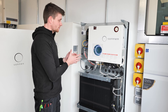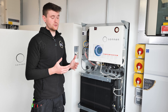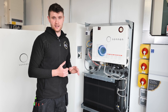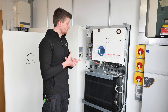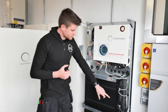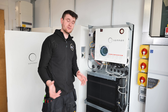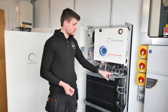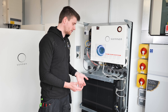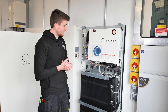All that comes into these power units is a main power supply fed from a local AC isolator, a six-millimetre cable, and a hardwired internet connection going back out. The Sonnens must have a hardwired internet connection — both for security and for the volume of data they transmit. On the master battery there's also a Modbus meter cable — just a Cat5 or Cat6 cable — going out to the meter. Battery power and BMS communications cables plug into the power unit so it can monitor state of charge, identify any faulty modules, and feed all that information to the Sonnen app.